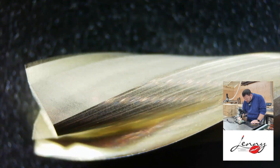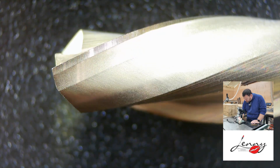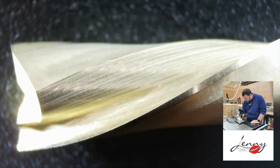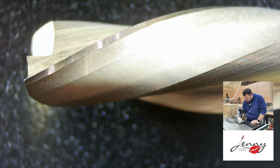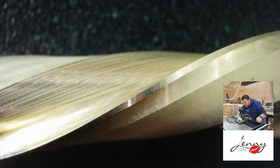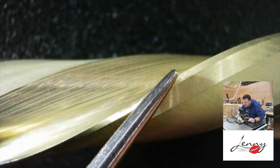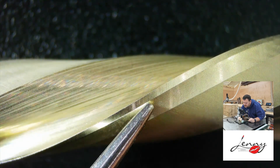Next up, the Jenny Bit. This one is coated, and if you're unfamiliar with coatings, they're put on bits to help with wear tolerance, heat resistance, and to add lubrication to the cut so they cut easier and longer. You can see it looks uniform. I can point out the cut and uncut parts — this is the unused cutting edge because of our depth of cut — and you can see just a little bit of wear right here in the transition zone.